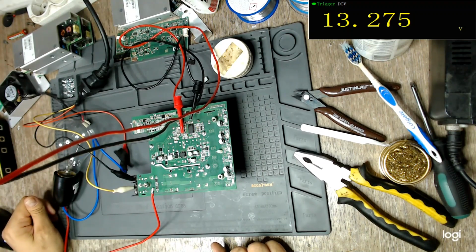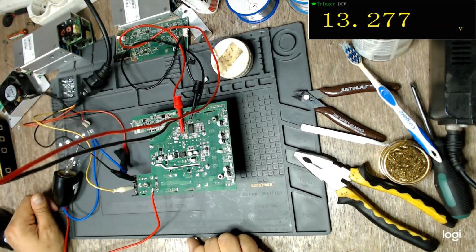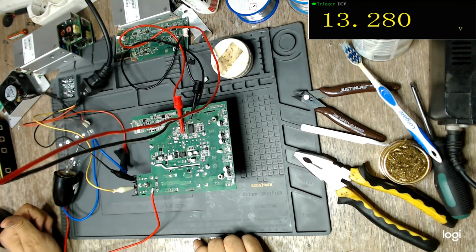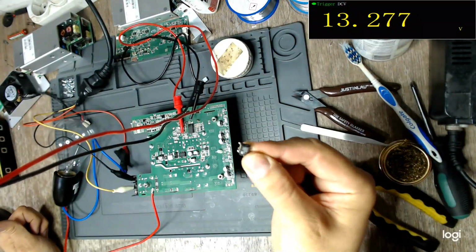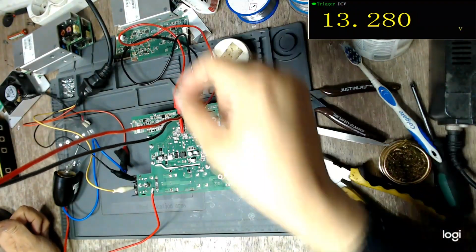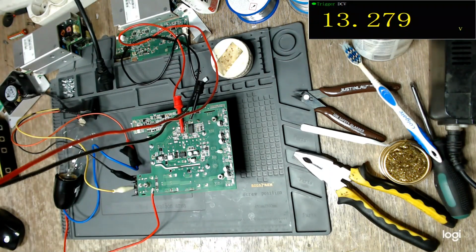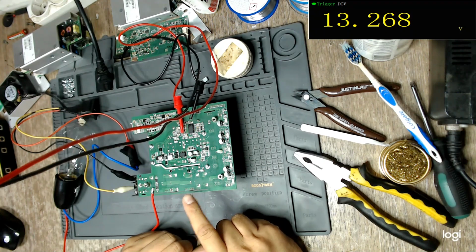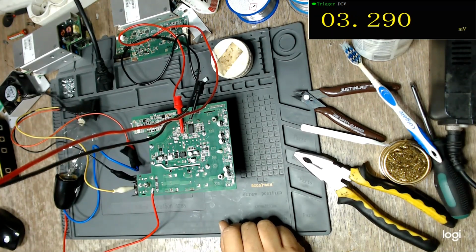So maybe the relay coil, flyback auxiliary supply and other stuff on the board draws enough power to partially light up that light bulb. So we have a working flyback supply. That's great. So indeed this damn thing was faulty. There are no shorts on the board because look, the flyback supply remains on long after I removed the power from mains. So no, nothing seems to be shorted on the board. So yeah, good news thus far.